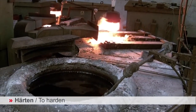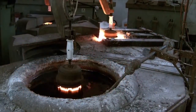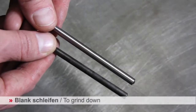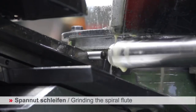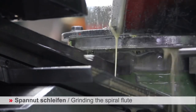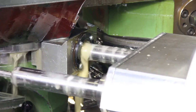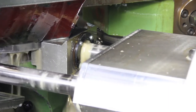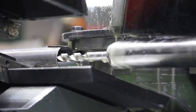These drill blanks are then heat treated and quenched to increase hardness and strength. You can see the before and after of heat treating. Drill blanks are inserted into a computer-guided grinder with two wheels made from boron nitride granules, which are tough and abrasive. The first grinding wheel shapes the bit into lengthwise spirals called flutes.